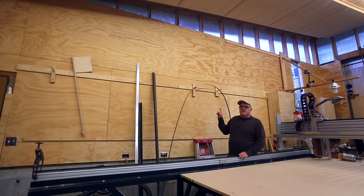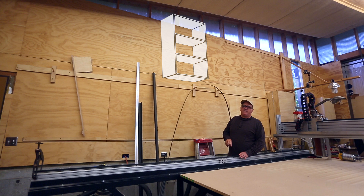The construction is basically two sides with dados and then four shelves that fit between those dados. On the back is a piece that holds it square, then a cleat on the top that it can hang on, and a spacer piece on the bottom.